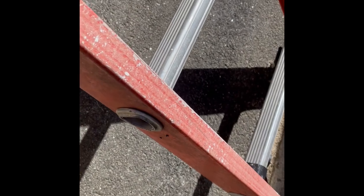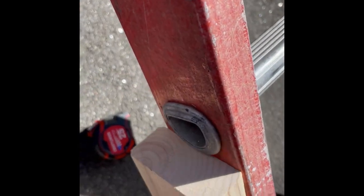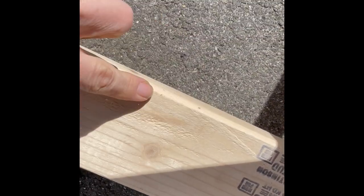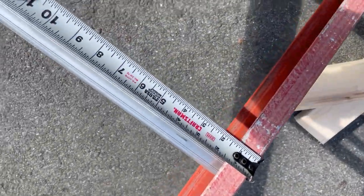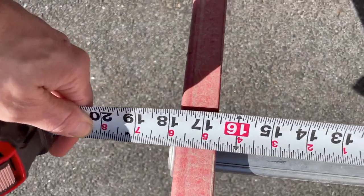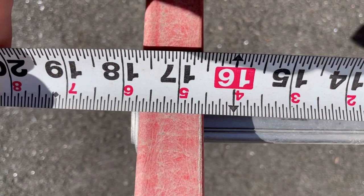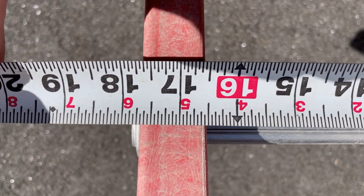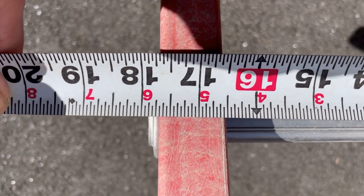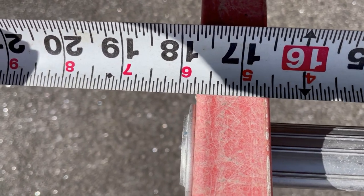Now these 2x4s will be riding up the side. But see, it's going to get caught here, so on the inside of this, we'll have to make thin strips. So this ladder is 17 3/4, and if we just look right here, we can eagle eye the ladder rung spots. So we'll give those a 1/4 inch on each side. So we're dealing with 18 1/4.